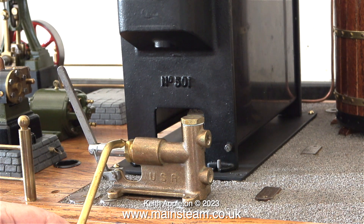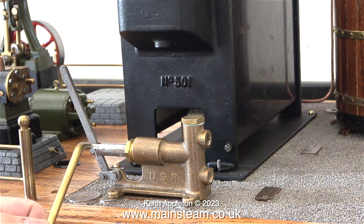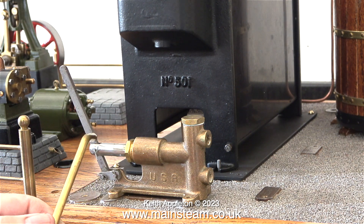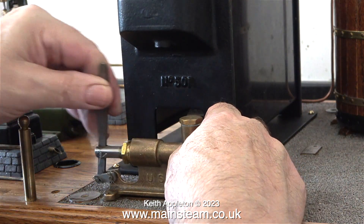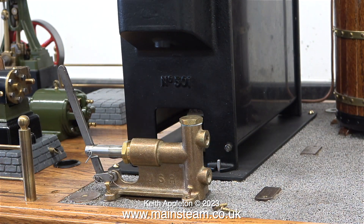In this clip I'm applying some oil to the moving parts — this is a good idea to prevent wear. You don't need a lot; just a small drop on every moving part should do the trick. The main lubrication of the ram in the cylinder is done by the water, but with the application of oil it feels a lot smoother already.